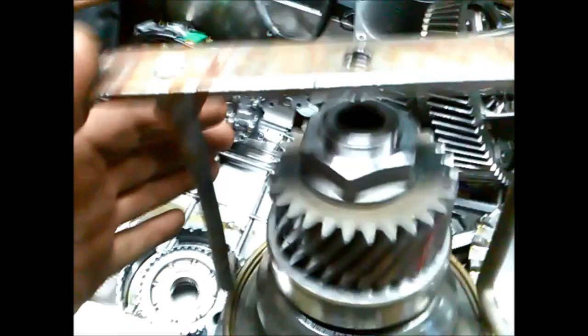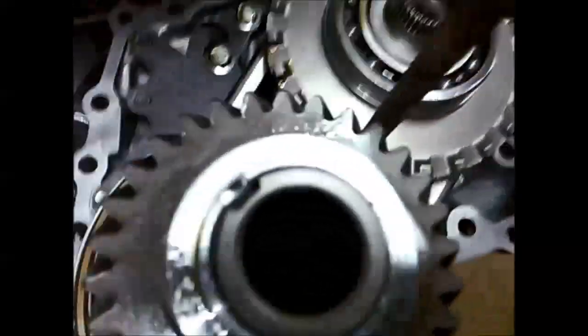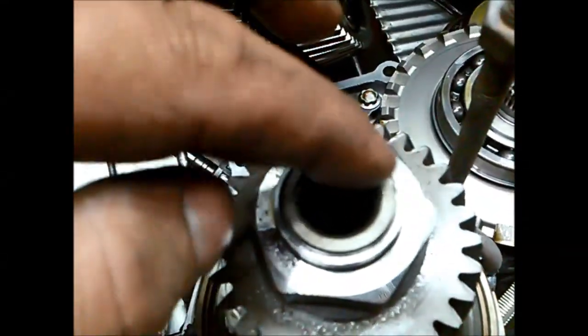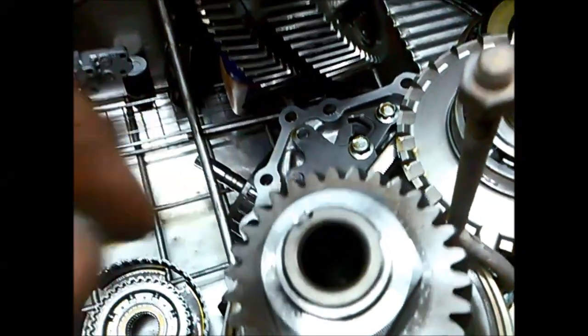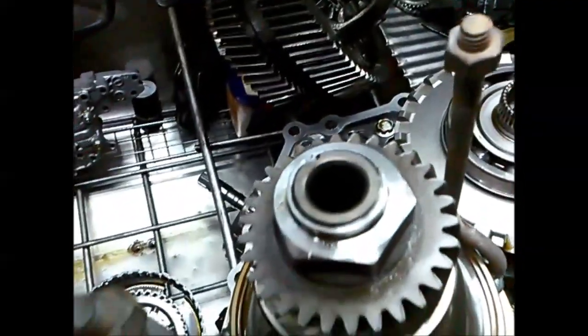You can see it's taking shape now. I need to make a little plug on the lathe that just sits in there so I don't damage that housing — just a little plug that sort of looks like a mushroom. It'll just sit in there and sit on top of that, and I'll have a centre hole. When I put the bolt in I'll just machine a point on the bolt and that'll be able to just pull it up.